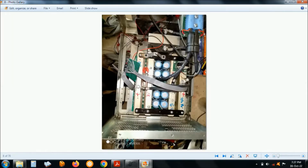This is the power block. Here's the positive block. The positive goes on the aluminum heatsink, and then the transformer terminal is here, and the transformer terminal of the other side is here. These are capacitors, and here is the ground that goes on the bottom of the power block, straight on the board. Here is the input, the 48 volts input, and here are the cables coming from the baseboard, which is the power board.